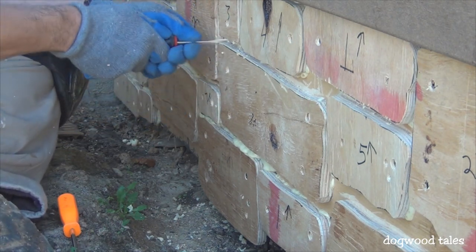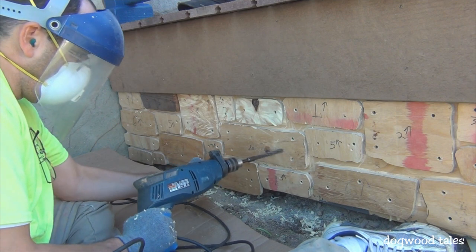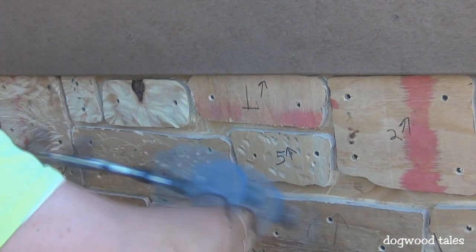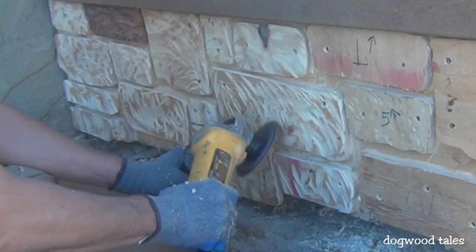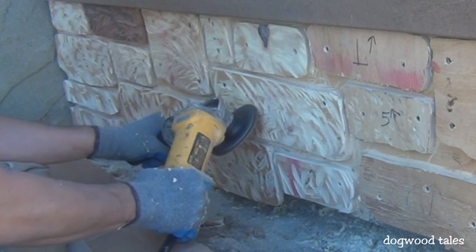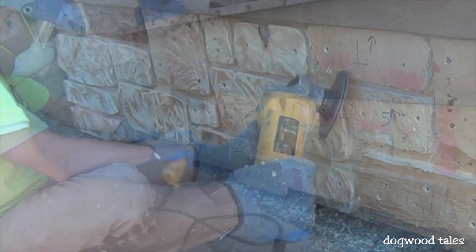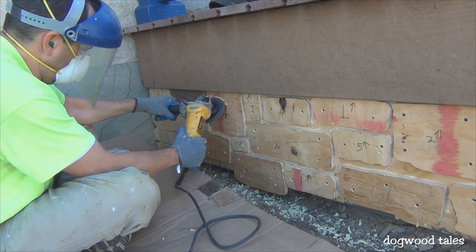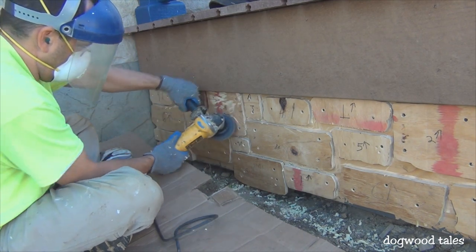The next step was to carve the stone shapes to look like real stones — at least to the 15-mile-away test. I tried a hammer drill with a masonry bit to add texture to the face but didn't like the results. I also tried distressing the face with a hammer, but that just looks like hammer marks. So I used my angle grinder with a 36-grit sanding pad attachment, and that worked really well. Keep in mind that using an angle grinder increases your risk of personal injury depending on your experience level. I am not using the guard on my grinder here, and I am not recommending you do the same — I'm comfortable with the risks. More information regarding angle grinder use and personal safety is available in the description.